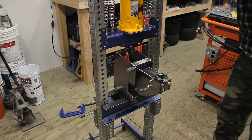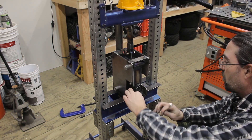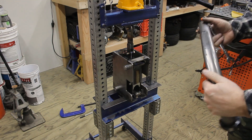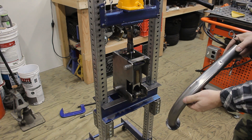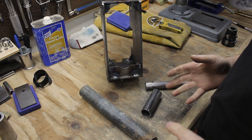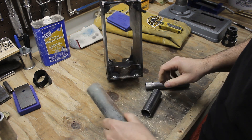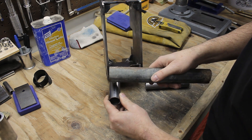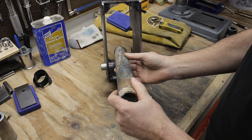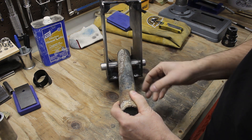I have to rebuild my tool rest. I got a big ol' dent in this one. I'm definitely gonna have to make a follower, cause that ain't gonna cut it. So my plan for a follower is to use a piece of pipe as a U-channel for the tubing to just slide on. I'm gonna mount it on top of this piece here. The whole thing will slide inside — it'll be a U-shape, about five or six inches long. Hopefully that tubing will just slide along it and not take a big scar on the back.